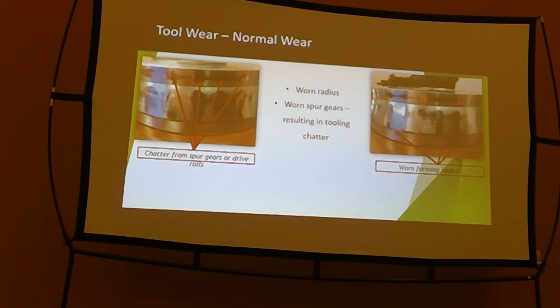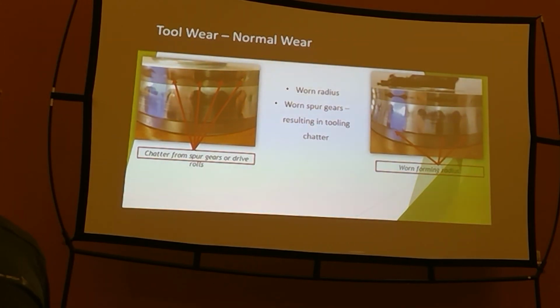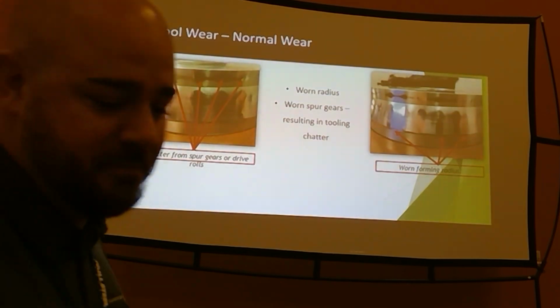This roll tooling, most likely the arbor, probably the keyways, were shot because somebody didn't lube a chain. You know, I see it fairly often, actually. Preventative maintenance avoids problems way down the line. That piece of roll tooling was far more expensive than a can of lubrication on your chain. Far, far and away. So take the 5 minutes, spend the time, keep your lubrication schedule up. It's a big deal.